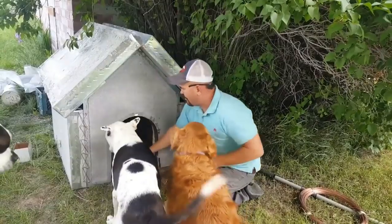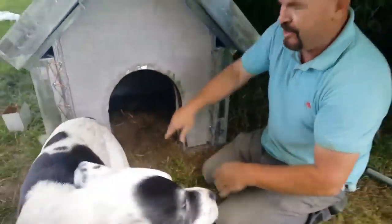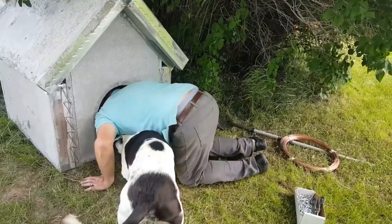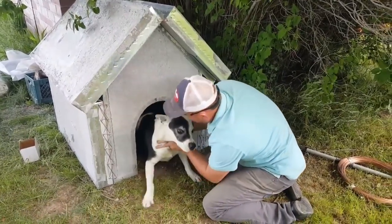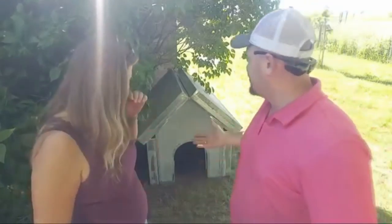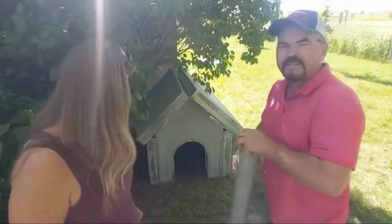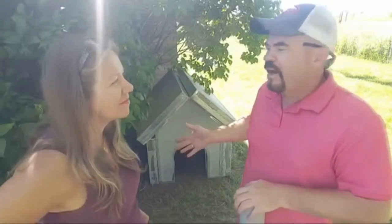On the roof panels I fastened them together at the top in a similar fashion. If I were to do this again I'd put an angle on the roof so they met at a good 45-degree angle, but I actually wanted a roof vent. Up in the corners where it spans the gap I filled those with expansion foam from a can. To finish the ridge vent system I took a three-inch cylinder — a piece of PVC conduit — drilled holes in it, and laid it right across that gap. I then used some commercial PVC roofing to go over the top.